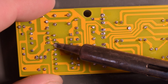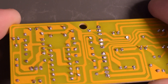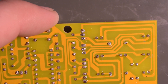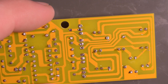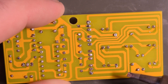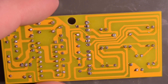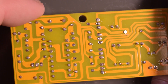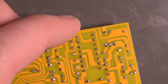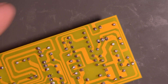That one's reflowed, as is that one. It's also possible that my voltage is too high, but usually five volts is okay. We also got this one here - usually nine volts is fine on a 555 timer. This one here kind of hangs over; I don't think the pad is actually touching there because there's a solder mask. Other than that, stuff looks okay. I'll also reflow these two connections for this 105 cap just to make sure - there is a little bit too much solder on there.